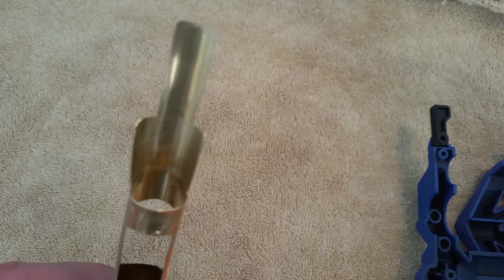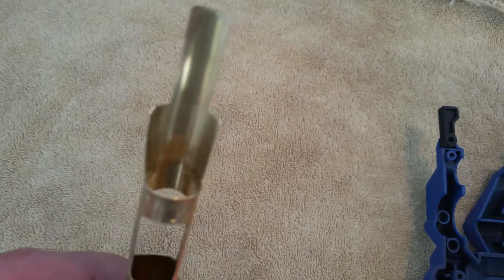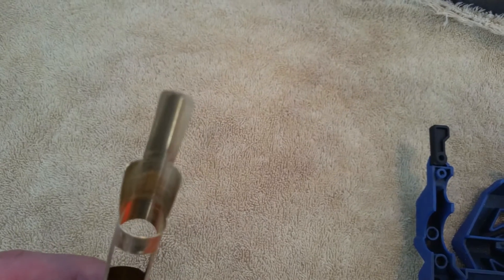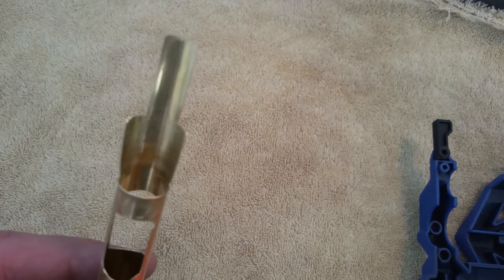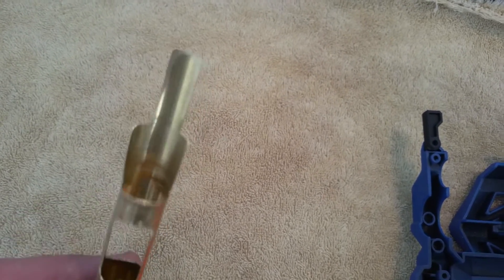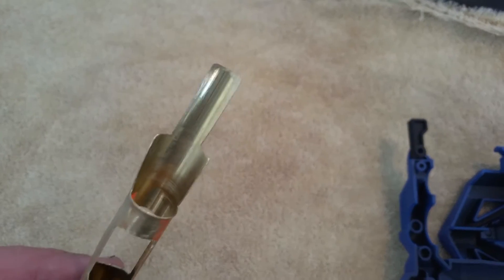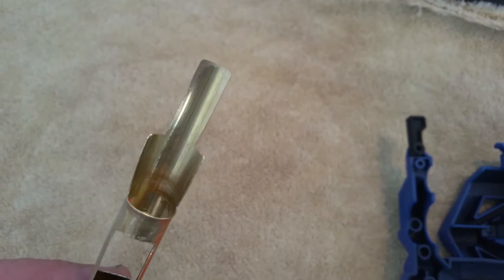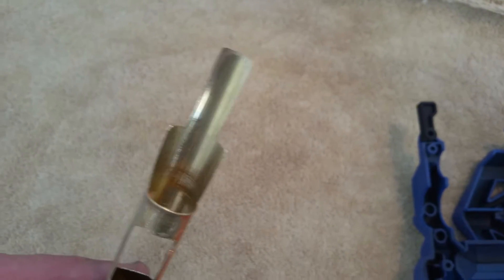You can see that I flared out the middle section, and that gives the dart space — it can be a little bit left, a little bit right — kind of go in there, and that gives you a nice consistent feed into the flywheel. The first and one of the most important parts about a brass barrel is how you're feeding it out of the clip, because that's one of the big advantages: you get a nice even consistent feeding of the dart out of your clip.